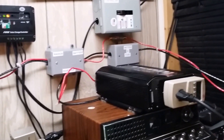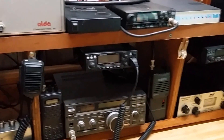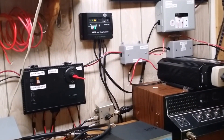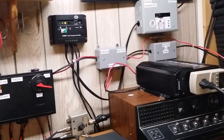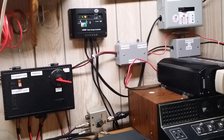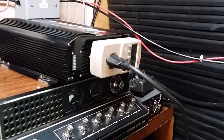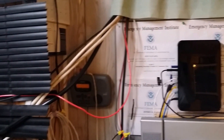That's how it's set up down in the basement — probably not the most optimal setup, but it certainly does what I need. I wanted to have backup power for my radios, which I can do, and I wanted to run lighting upstairs off the load from the charge controller. The problem I was having is by 11 or 12 o'clock in the afternoon the charge controller was flashing telling me the batteries were full, so I felt like I was wasting solar the rest of the day. That's why we've got the inverter hooked up now — we're going to run the modem and router to use some of that excess solar.